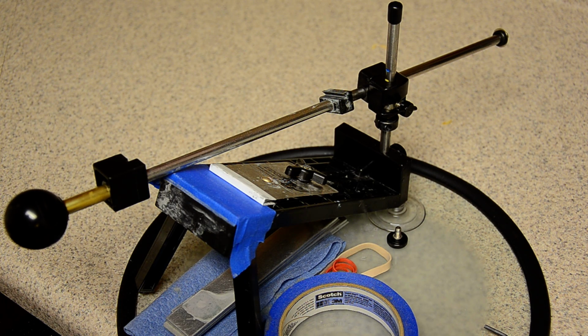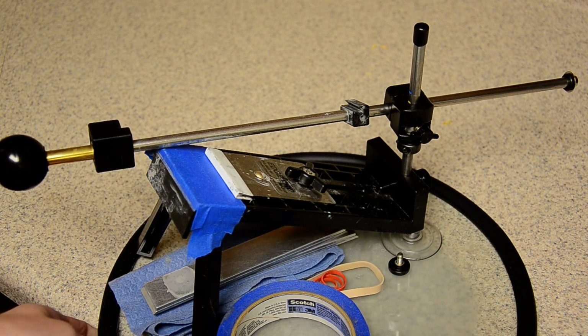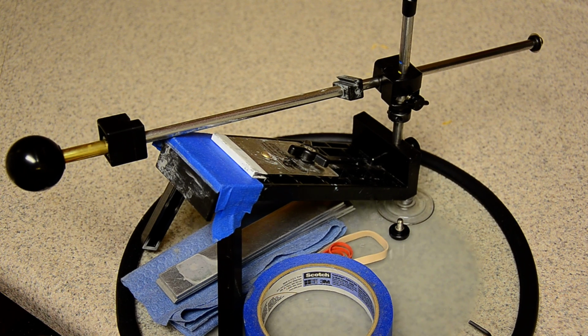Most people don't know that the difference in thickness of the stones, if you're not adjusting for it, is going to give you trouble. It's going to give you so much trouble and you don't even know it. And a lot of people don't know their stones are different thicknesses. They can appear to be the same, but there are subtle changes in the wear rate. They are different, I promise you.